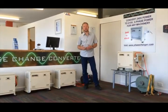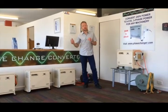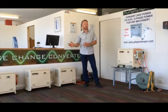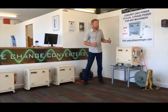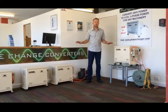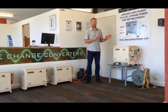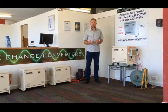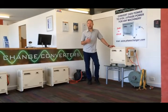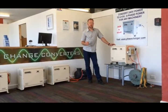And the same with 480 volts. If you have 480 volts on a rural property, for example, we can still give you 415-volt three-phase out the other side. This is based around the rotary converter technique, which is a little bit different to an inverter. We have a pilot motor internally — we'll have a look at that internally in a minute. The good thing about a rotary converter is it means we can have multiple loads running on the one product.